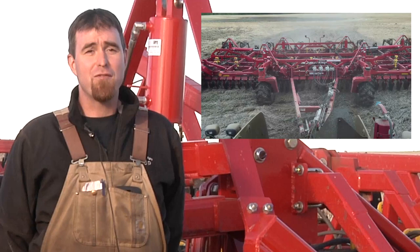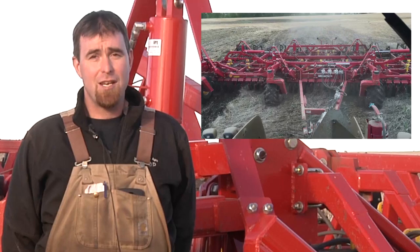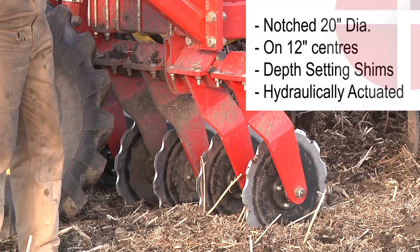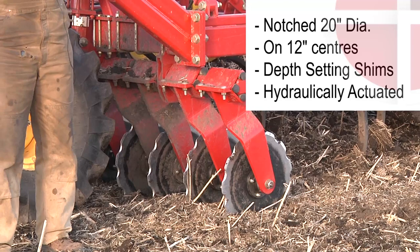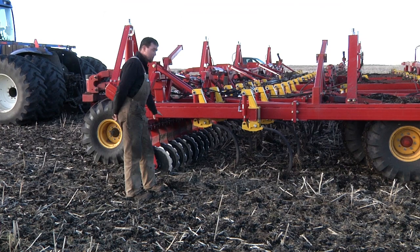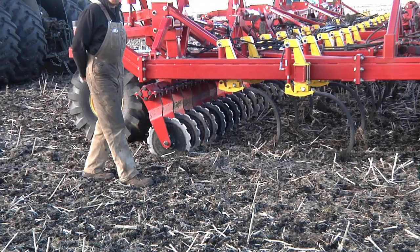Putting the soil back together is actually a fairly important part of the soil prep system, and you can do it with one unit that's heavy enough to get into the ground in the fall as well as in the spring. In the front of this machine we have cutting coulters that are on row, and to make it effective you need to have those coulters running fairly deep. In the spring that's not a big deal, but in the fall it's often very difficult to make sure the coulters are getting low enough to avoid hair pinning or other concerns with field preparation. Behind the cutting coulters we have five-sixteenths notch discs that work really well to get them into the ground.